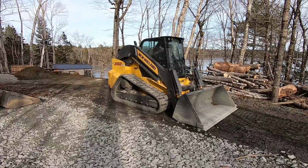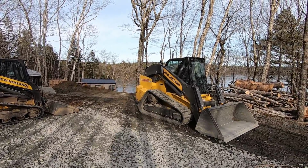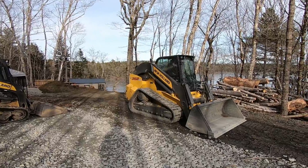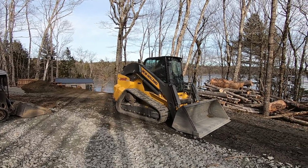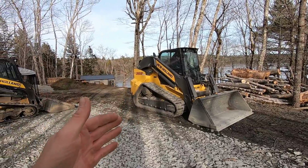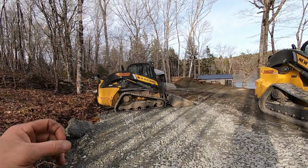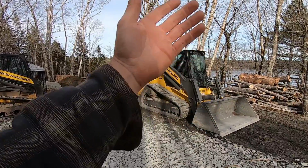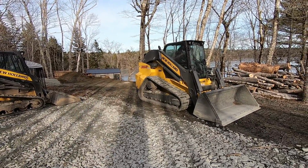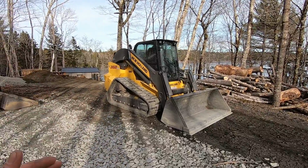And again, steel tracks, because if you're doing brush clearing and mulching and all that sort of stuff, you're in bad terrain. It could be rocky, it could be muddy, whatever. These things are heavy enough, and with rubber tracks on, you don't get a lot of traction compared to an excavator or a dozer with steel tracks. So in my opinion, you're buying this machine with steel tracks.